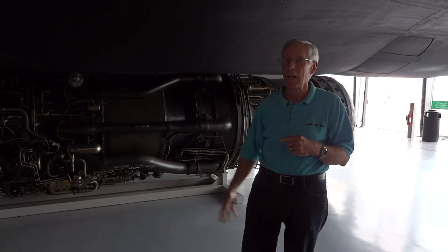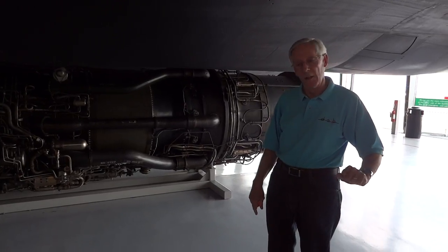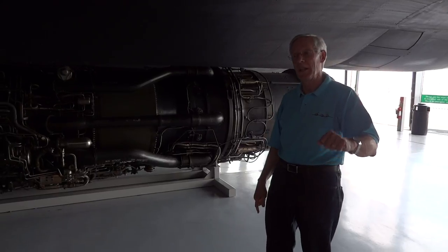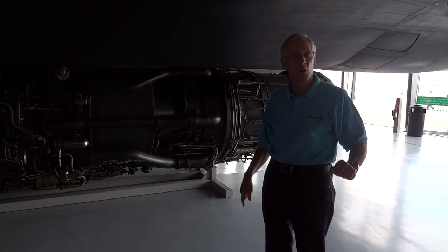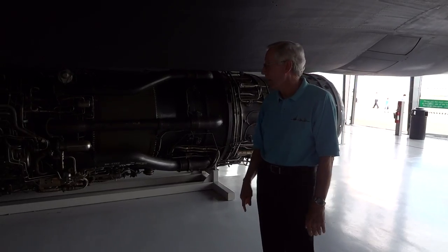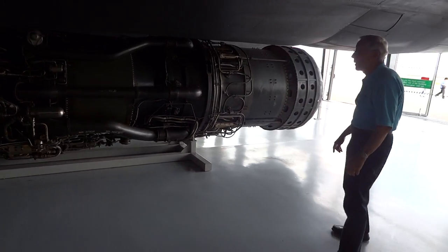So Kelly said, okay guys, come up with some way to ignite this JP-7 — and that's what they came up with: a liquid chemical. We had 16 shots on each engine and a little counter on each throttle. As soon as you start the engine it goes from 16 down to 15, and when you light the afterburner you go from 15 down to 14. So you kept track numerically on this little mechanical counter — click them off, 16 shots per engine.